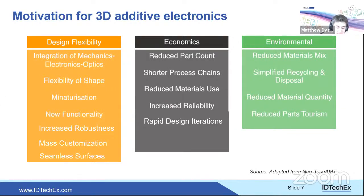Additional design benefits include adding new functionality — capacitors can be integrated without mounting a separate component, potentially enabling larger capacitors that are more robust because they're embedded in the structural dielectric. Mass customization is also possible: because devices are printed digitally without masks, each can be subtly different, ideal for products like hearing aids or custom medical devices, decoupling unit price from unit volume.